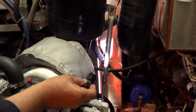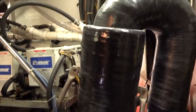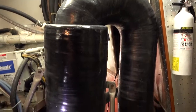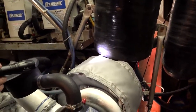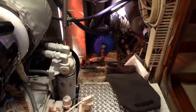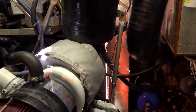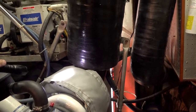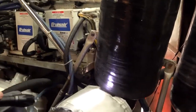There's water injected — there's a hose right here that injects it so that it cools the exhaust. You want cooled exhaust so you don't burn the boat up. It's attached to exhaust hoses that would melt. The exhaust is somewhere between 600 and 800 degrees, which is not good for exhaust hose rated at 250 degrees.